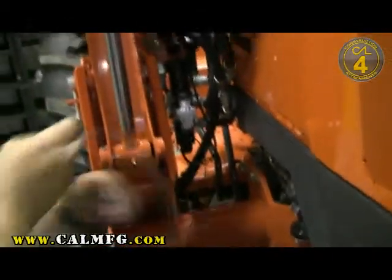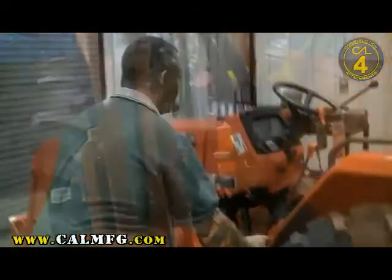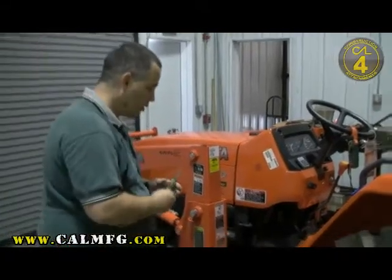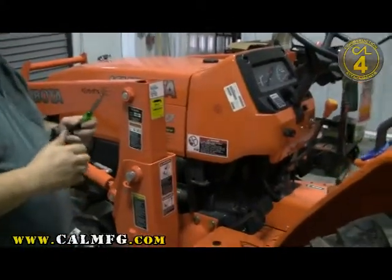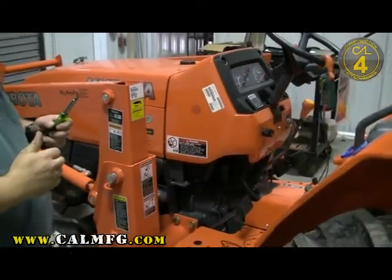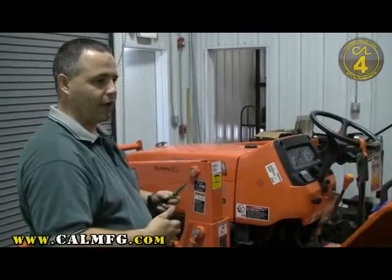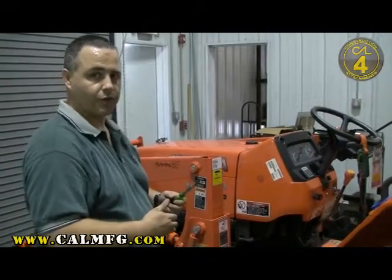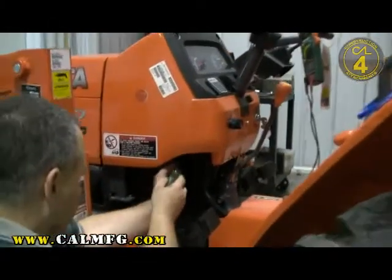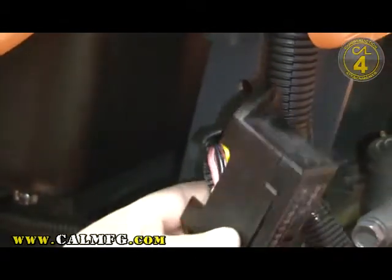So I'm going to need the fusible link out of my kit. I'm going to need to locate the fuse box. What we've got to do in the electrical installation is locate our 12 volt power source. We want to locate a wire that has 12 volts DC when the tractor switch is in the on position. It doesn't have to be a wire that's only hot when in the on position, but basically that means your handle doesn't have any power whenever the tractor's turned off, so it's ideal to locate one. Once you've located the tractor fuse box, you need to remove it and get to the wires behind it. They're normally relatively easy to access, though some are a little tighter than others.